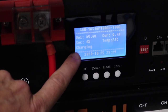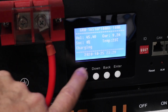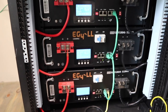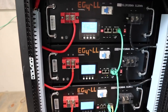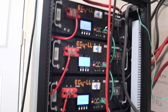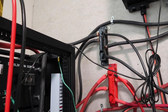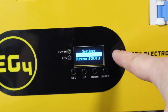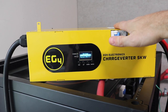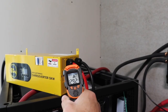Let's check our batteries. The state of charge is showing zero on this battery — not sure why — but it is charging at 9.2 amps. The three batteries on the bus bars are charging at 12, 11, and 12 amps. All of them are charging at anywhere from 9 to 12 amps through those two bus bars. Now that everything's working, I've cranked it up to 56 volts at 100 amps. It's getting quite hot — about 113 to 115 degrees on the front, and around 130 degrees internally. Let's let them charge and we'll be back later.